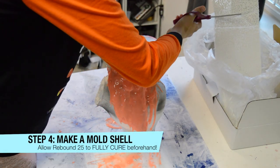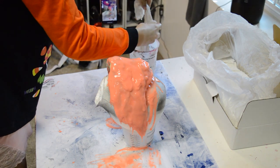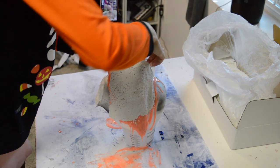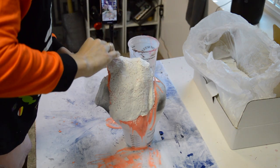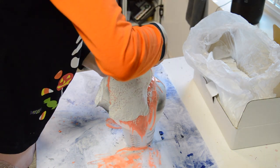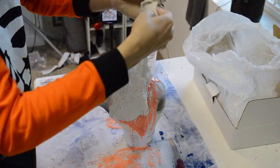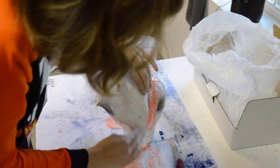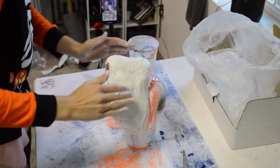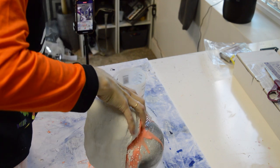The thing about a brush-on mold is that when you pull it off, it is just a floppy mold with no way to retain its shape so you can pour something into it — whereas a pourable mold is basically like a mat with a mold inside. So for this, you actually have to make a shell so it has something to sit in to retain its shape while you pour whatever resins you want to make your new item. You have to use a gauze plaster bandage — I'll put them in the description below, I get them in bulk. All you have to do is have a cup of water on the side, dip the bandage in, and pull the water out — don't leave it sopping wet. Then apply it to the outside of your fully cured mold. Don't do this until it's fully cured; I usually wait an entire night. I apply about three or four bandage layers and then smooth and smear the plaster to make a nice shell. Once that's completely cured — give it several hours and keep checking on it — be very gentle as you slowly pull it away from the silicone.